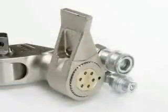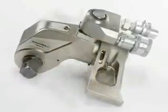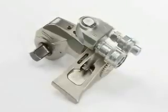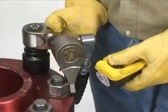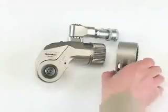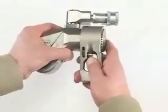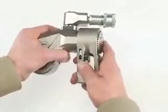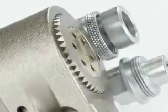To mount the reaction arm. Because of the rigid steel design of the S-Wrench, the reaction arm can be rotated incrementally around the tool with maximum torque limited to the range shown. This will maintain stability against a reaction point up to full torque. Position the reaction arm onto the ratchet end of the tool. Press the latch and slide the arm all the way onto the tool, then release the latch to secure the arm. Approximately one-eighth inch of the splined end of the wrench should be visible on the outside of the reaction arm.